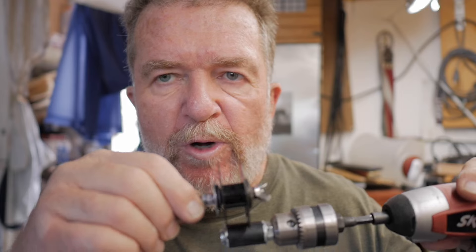For most typewriter spools I'll be using this rubber drive roller system for driving the reels. But if I'm winding up a ribbon for a Remington-style spool, all you have is the metal ring in the middle, so I'll be using a Speedy Spooler type of setup for a Remington spool, and we'll have that on hand in case we need it.